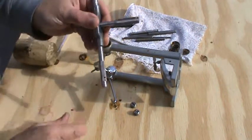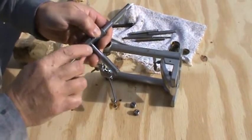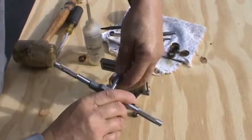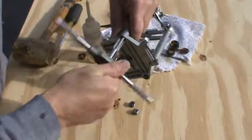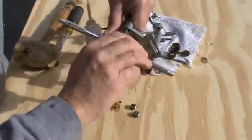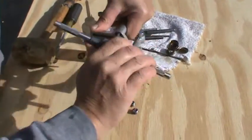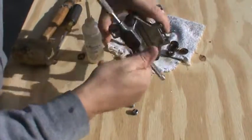So what I'm going to do is take a tap — it's a half inch 20 National Fine NF — and I already put some oil down in here. I'm just gonna do one of these for the video and it's kind of tight, but it'll clean it up real nice and allow these screws to move a lot easier. Of course you want to grease them when you put it all back together, and I'm only going to turn this thing down to where it starts to bind and stop.